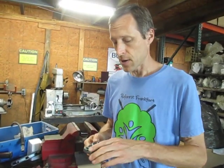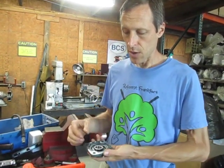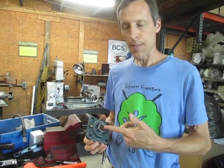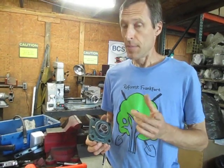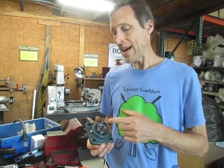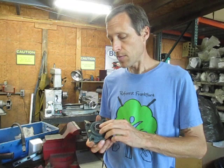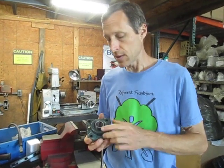The general construction of these things is you've got a cast iron outer housing and you've got a ball bearing insert that goes in it. A lot of people think that the bearing is part of this thing, but it's not — it's replaceable. Other people think it is pressed in with a gigantic press, but no, it is actually inserted by hand and you can replace it yourself.